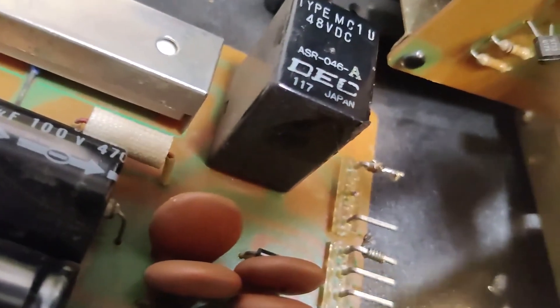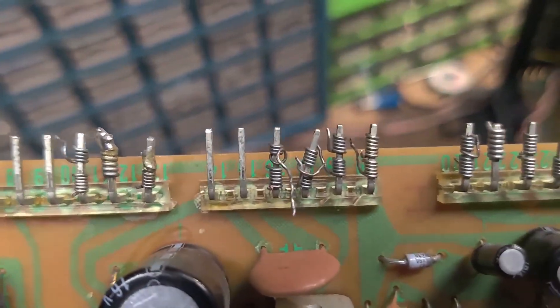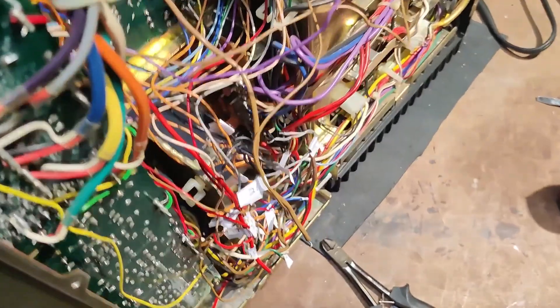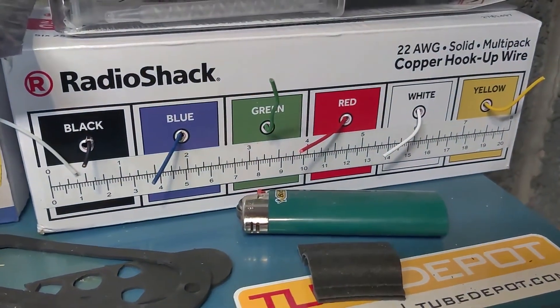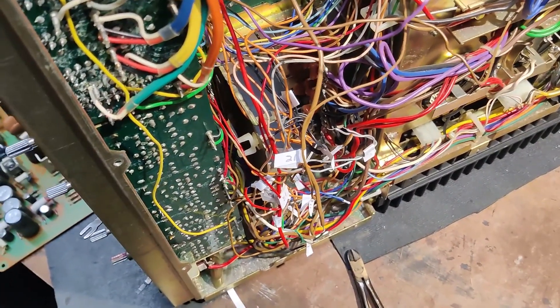Got the power supply card out. As you can see, there is a broken pin and previous tech work in here — they just had this soldered right on top of that. There was not a lot of care taken into this, but I'll go ahead and clean all these up, repopulate the card, and then take care of this rat's nest back here. Everything is labeled. I will be replacing some of the wire because there are a couple of runs that look like they've been serviced before and are a little too short. I do have some 22 gauge hookup wire which is solid core copper, so it is high quality and will make servicing this in the future a little easier.